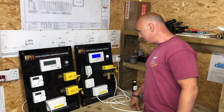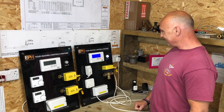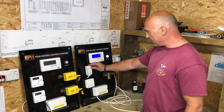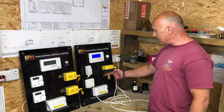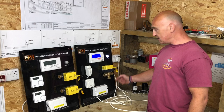Now, do you want to explain to me, if you have your hot water and heating on at the same time, put them both on, how does that work? What's happening with the valve? So first of all, put them on. It's now going to call for heating and hot water. The mid-position valve has a ball inside there, isn't there? That's right. And that will move into the centre, so it allows water to pass up through into the central heating system as well as the hot water. Water will pass both ways on this occasion. Yeah, that's exactly right. So it's a mid-position valve.